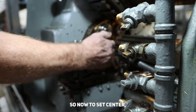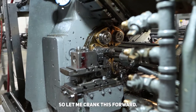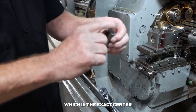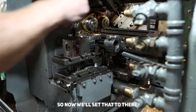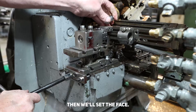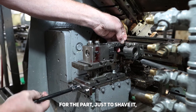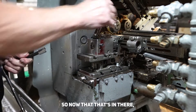Now to set center we need to know exactly where we're at on the holder. Let me crank this forward — I can go to the top of the cam. Now I have this gauge which is the exact center for the part. We'll set that to there. First I'll have to back this up, then we'll set that face. That'll put us on exactly center for the part. To shave it you go right to the center of the part, so now that just fits in there.